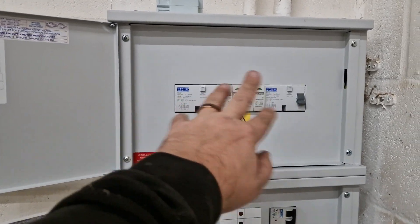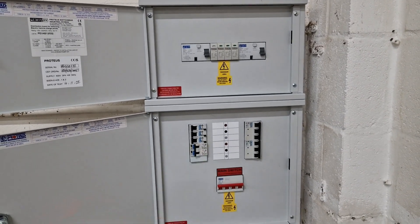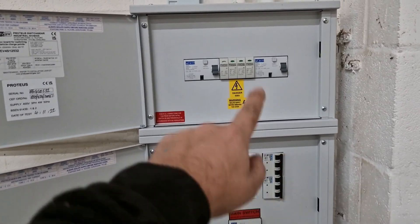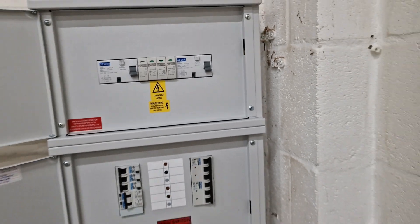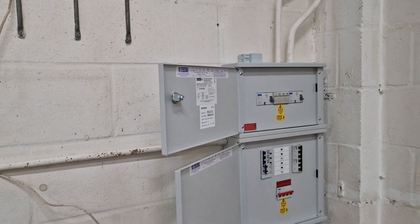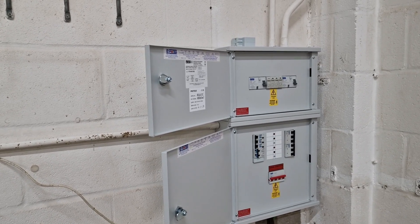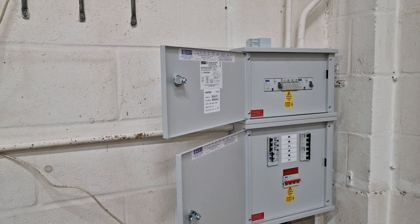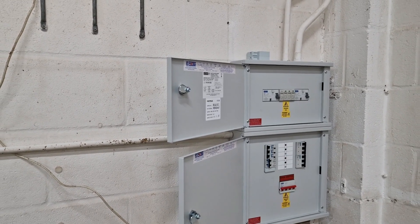You can see we've got the power on. I've put the other RCD back in just to fill the hole because I only had two of the spare blanks so just to make sure no one can put their fingers in there in the meantime. We've got the breakers in at the bottom — at the minute we've only really got the lighting circuit and the water heater. There's nothing else running but it's all ready to go for the future. We've got the SPD powered and this RCD at this side is all energized and ready to rock with the EV charge point. We're waiting on getting all the tidy-up work done on the main intake — the DNO guy hasn't left it in the best condition but it is temporary so I don't want to do him a disservice by showing it on video. He has been back and popped all the fuses in — he needs to do some further repair work on the cabling coming down to our unit.